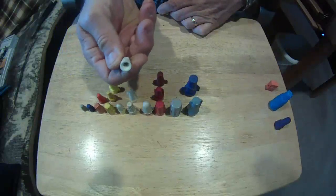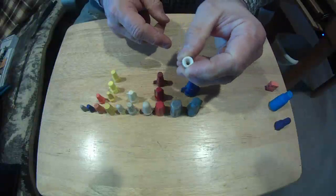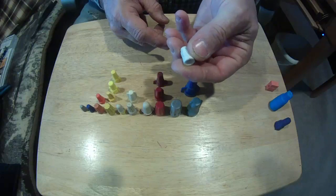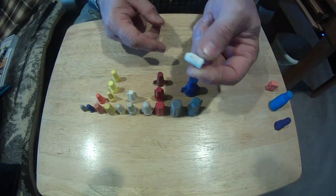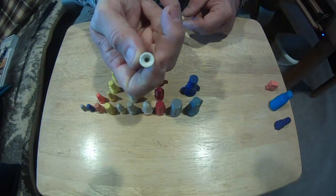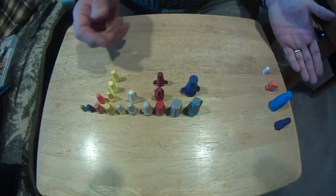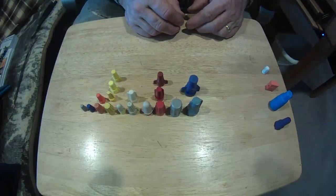And then this is a porcelain wire nut. It's made out of porcelain. It's made for high temp situations, like on a stove, an oven. You see it's still threaded, but there's no spring in there. So it'll take high temperatures. So this is what we use for our wire nut situation.